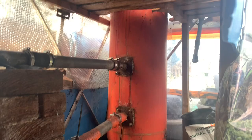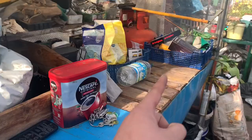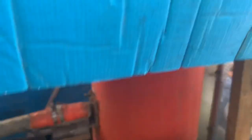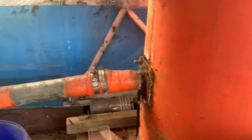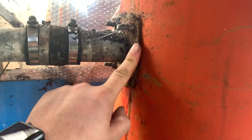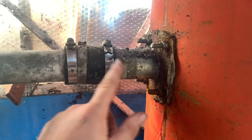The pipe runs into the tank which is in the corner over here. The tank is made from a 47-kilogram gas bottle — the top's been chopped off, it's been knocked flat at the top and on this side as well, and a flange has been bolted on with some pipes on the outside so we can connect these pipes up to it.